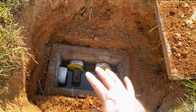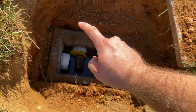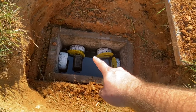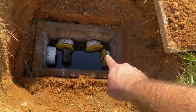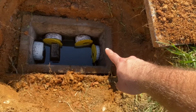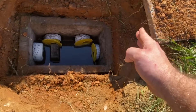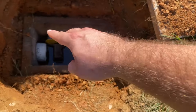Now, let's say that the trench over here is getting too much water, it's oversaturated, and we're starting to have some problems. What you can do is rotate the hole for this one up to the 12 o'clock or 3 o'clock position, and lower the holes for these ones so that they start to pick up more of the slack. The goal of a distribution box is to have even distribution into all of your trenches so we can get the same lifespan between all three.